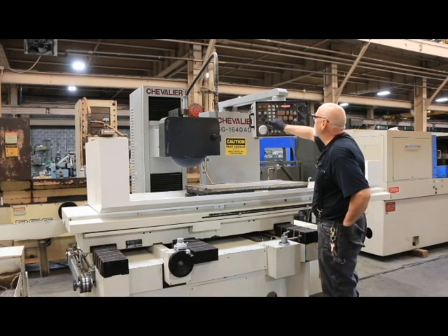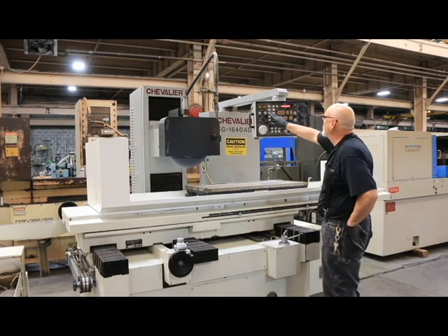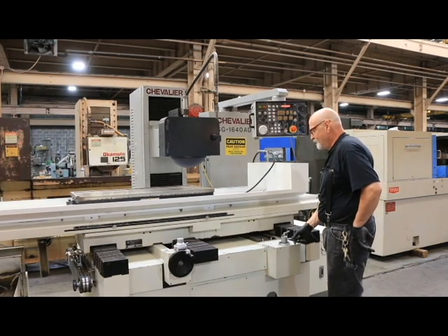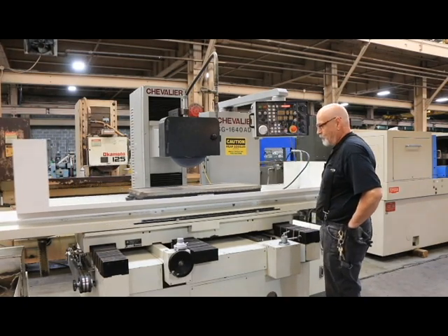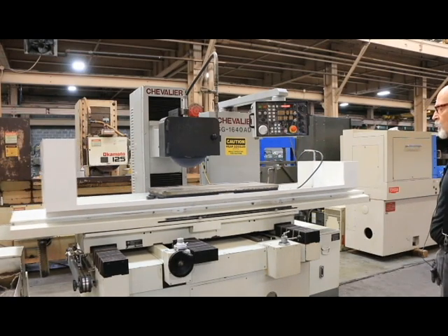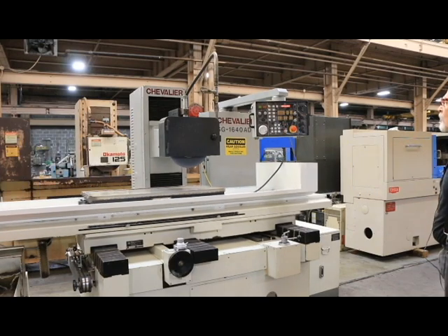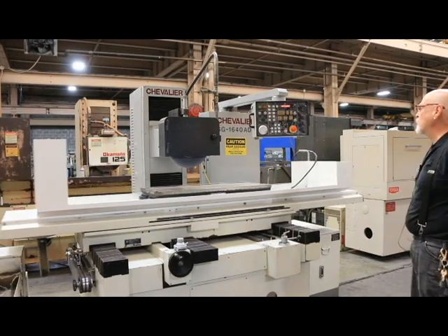We also have a surface grinding mode. We have to go up to the next selection. Start our wheel again. You've got to remember to shut it off before starting the pump. Start the cycle. Now you see we've got the cross saddle — I'm going to speed it up a little bit. We've got the cross slide or cross saddle working now. Each time we reverse the saddle, we're going to feed down our one-thousandths. So instead of going by the table reversals, it's going by the reversal of the saddle.